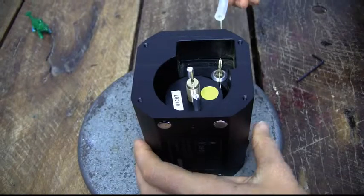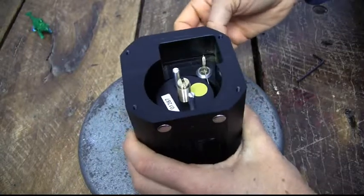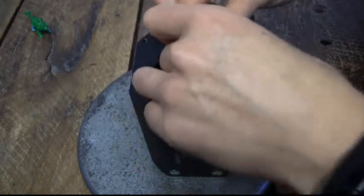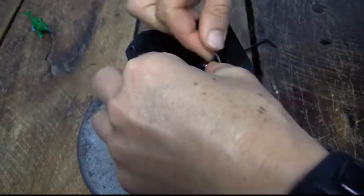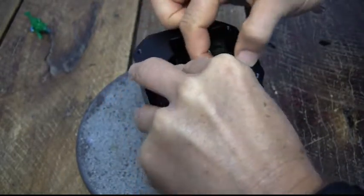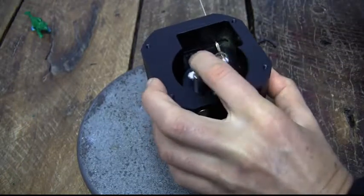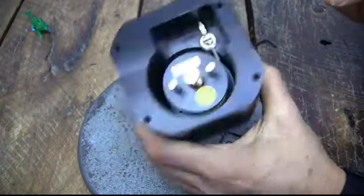Okay, there's still a little bit of slackness you can see in the tether here, so what I'm actually going to do is I'm going to repeat that process again. So I'm just going to pick out a little bit of the tether, I'm going to wind it over the pins in an anti-clockwise method, and then with my finger on the pin so that the tether doesn't slip away, I'm going to manually wind it on, let it retract. Okay, so you can see it looks, the tether's tensioned.